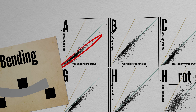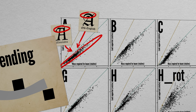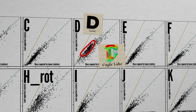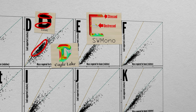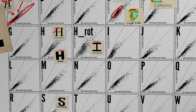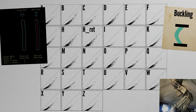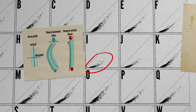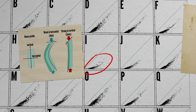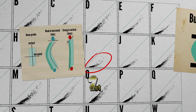In bending, A's are almost always below the good-bad line. Weirdly, it's the old calligraphy scripts which do well, with the extra top bits providing support to balance out the base. D's are best overall, with good support at the top and bottom and a reasonably symmetric design. E's have good strength but waste mass on that central stroke which doesn't help with load. Rotated H's do significantly better than both regular H's and regular I's, since they almost always have flanges at the top and bottom. Buckling failure occurs in compressive loading with beam deformation in whatever direction causes the least resistance. Straight-line I's are particularly susceptible because although they're strong in the vertical plane, they're weak horizontally — and that's where failure ends up occurring. O's and D's end up dominating.